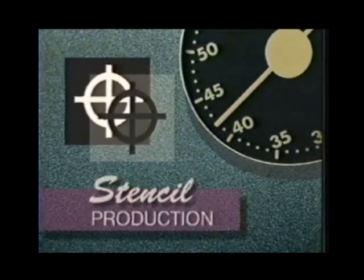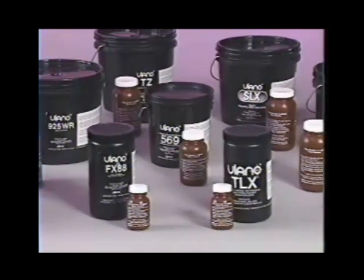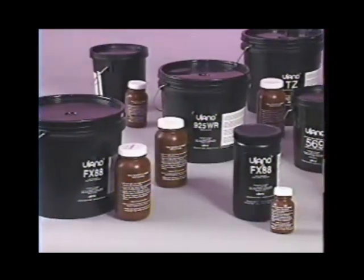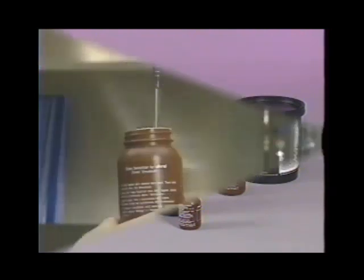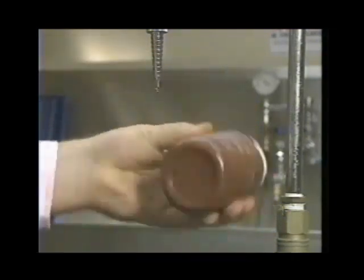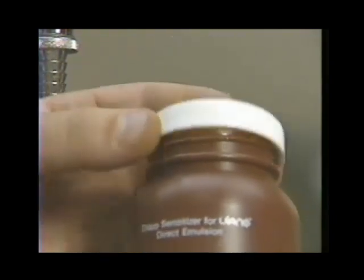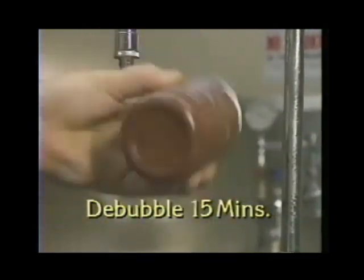Now that the screen is properly prepared and thoroughly dried, it can be coated with emulsion. With the exception of Ulano's SBQ pre-sensitized emulsions, all Ulano direct emulsions are supplied as two basic components: a liquid emulsion and a sensitizer in either powder or syrup form. For this demonstration we are using the powder sensitizer supplied with Ulano 569 diazo emulsion. First, add lukewarm or cool water up to the shoulder on the sensitizer bottle and shake well. Check the liner of the bottle cap — particles of undissolved diazo remaining on the white cap liner indicate that further mixing is required. Once completed, allow the solution to de-bubble for 15 minutes.